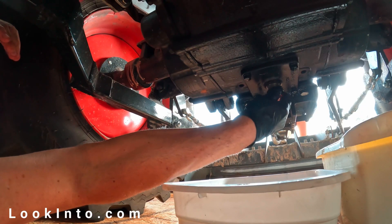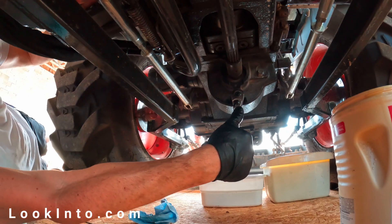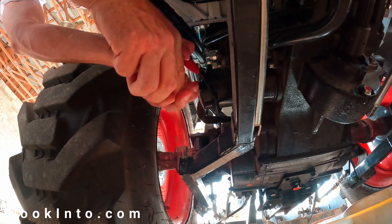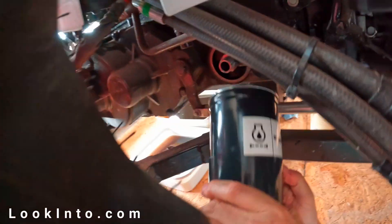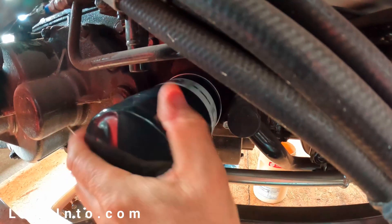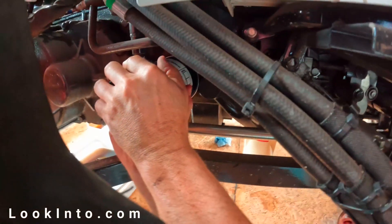Clean off and replace both the 30 millimeter and 14 millimeter plugs. Now remove the filters — I've heard horror stories about how hard these are to remove, so have an oil filter wrench handy. I started on the right side, which is the hydraulic filter. I heard this was the tough one, but it came right off — not tough at all. Just like with the engine oil filter, put some trans diff fluid on the o-ring, then hand thread on and snug it up. The right side gets the gray colored filter. I'll list all of this with part numbers in the description below.